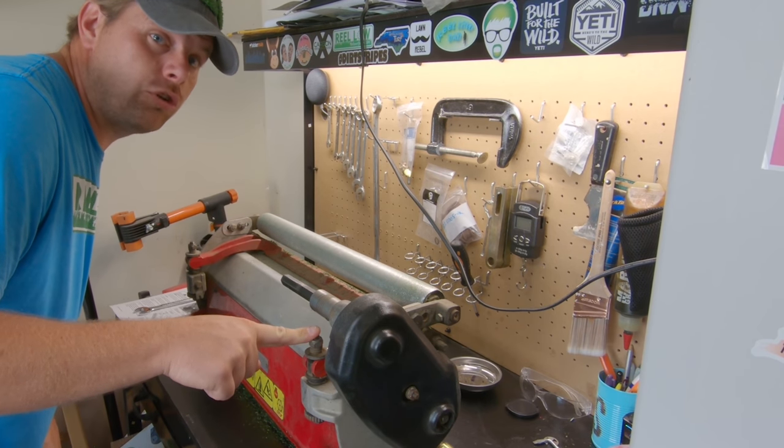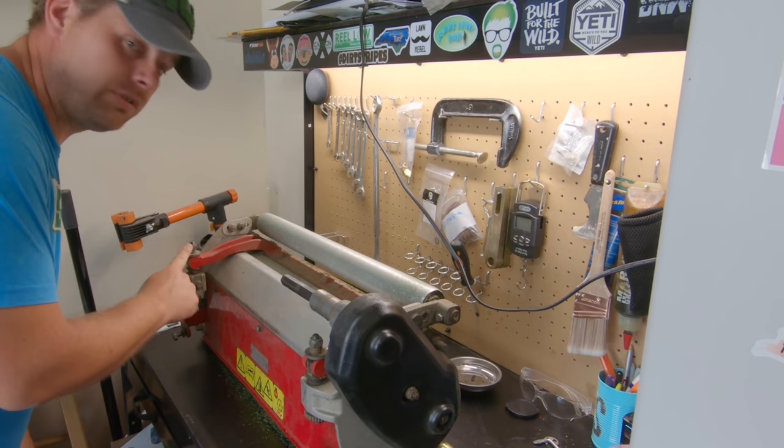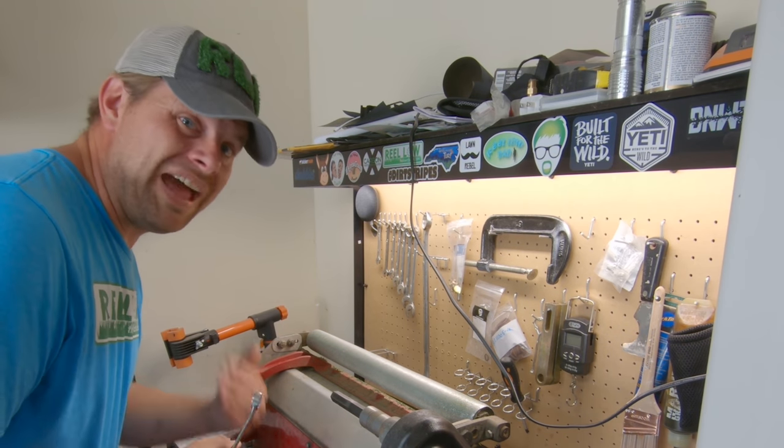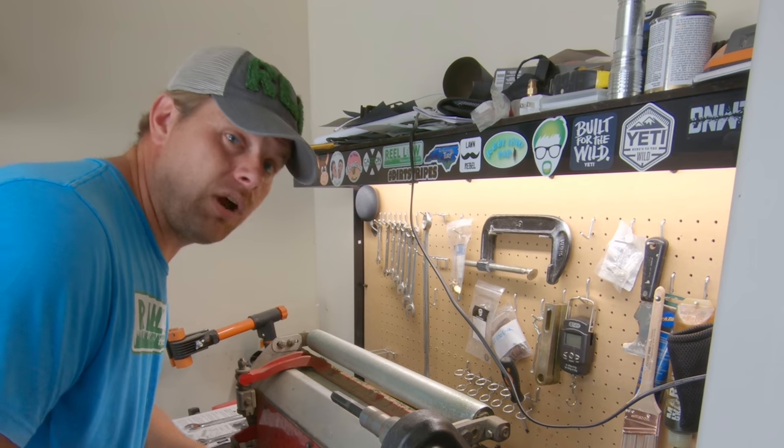This one took a whole lot more turns to get loose versus the other side. The reason behind that is the reel has taken on a conical shape, which is normal — it happens over time. The solution is you have to regrind the reel. I need to pump the brakes and talk about reel grinding again since there was some confusion in my last video. If a reel is in a conical shape, you have to have a spin grind performed to reshape it. I advocate for relief grinding because the manufacturers advocate for it and turf professionals all over the world advocate for it.